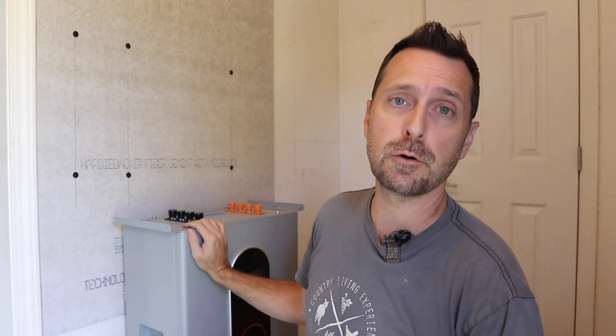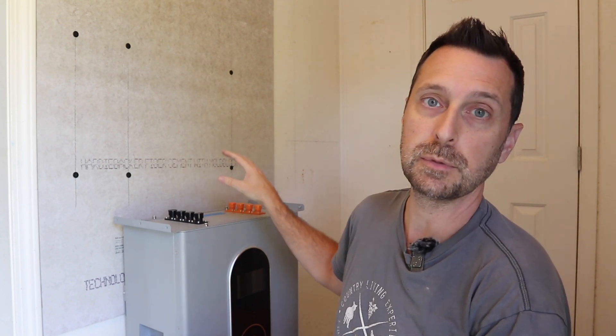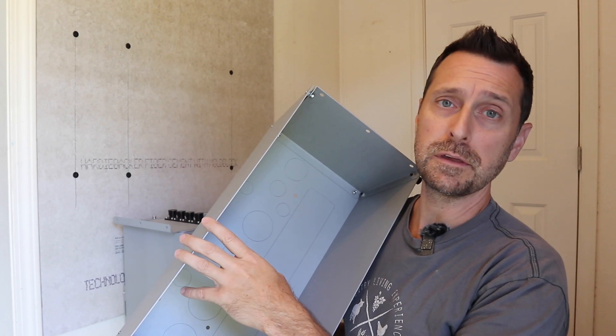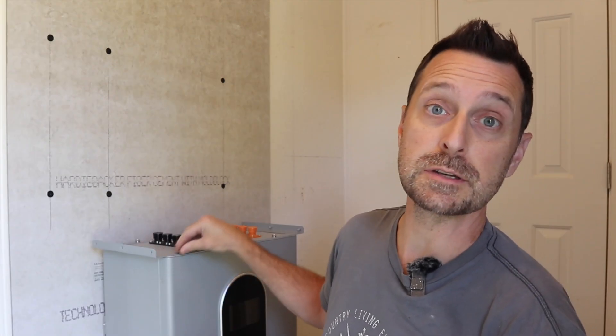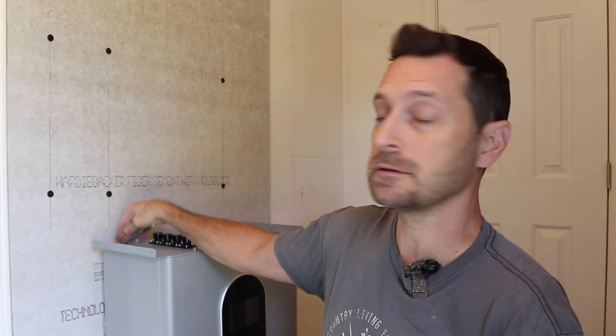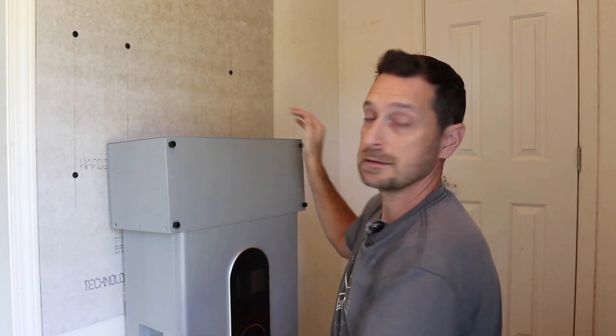All right, let's start hanging stuff. We are making progress. We've got our hardy on the wall, we've got a lot of these timber lock screws into the studs. We've got our wall mount EG4 battery right here and we've got our conduit box together. These are really nice and I recommend you probably get one of these to contain all the wiring between our wall mount battery and the 12k. These don't come with any instructions but it's not rocket science — it's a box. The bottom mounting plate mounts directly to our wall mount battery and it's got a grounding wire attached to it. We'll attach that to the ground screw on the battery, get the proper knockouts for our 12k, and then connect this together.